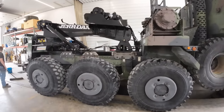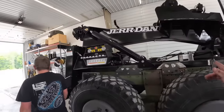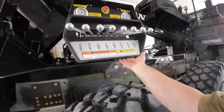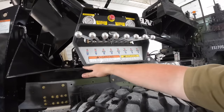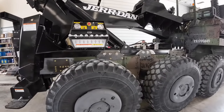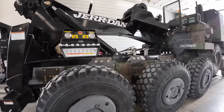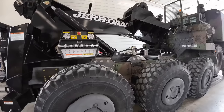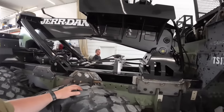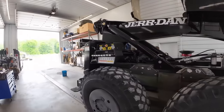All right, so we need to let the air out of this truck, I think, don't we? Slam her down to the ground. Okay, you guys remember the previous video? Actually, the first one, we put a dump valve on and let the air suspension down. So I want to let it down. We've got about 3 or 4 inches of clearance under it. Basically, we're going to put the top of the fender right flush with that right there. So I got some 3/16 diamond plate. You guys can see that going downtown there. We're going to form and build some fenders out of it. Make some channel brackets up. And then I think I've got some 5 foot long toolboxes that will set up here, where all the hardware and all that kind of stuff goes.